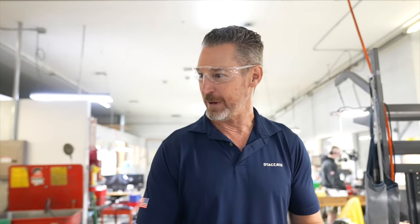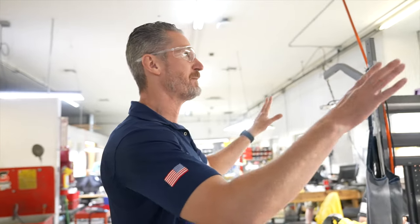This area is central to the assembly and gun-building side of the business. The team over here is working on what we call function. Those pistols have come down, they're kitted, and the team does everything from fitting the thumb safeties and grip safeties, to blending, removing sharp edges, and chamfering. Once that's complete, the pistols go for coating. When they come back from coating, they come to this team — our finals teams.